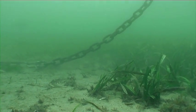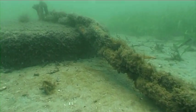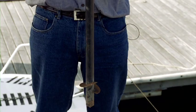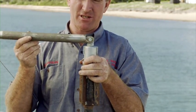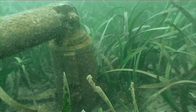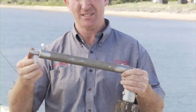I'm the inventor of the seagrass friendly mooring system. We saw a need up in Newcastle in Nelson Bay, where my home base is, for a mooring system that will counteract the damage being done by current moorings. The way our system works, we replace the traditional block of concrete with a single screwed-in-to-the-ground anchor point. On top of the seagrass mooring is a drive head with a 360-degree swivel. When the boat changes direction, the swivel rotates and the shock absorber points to whichever direction the boat is in.